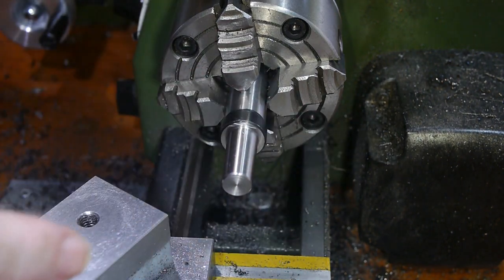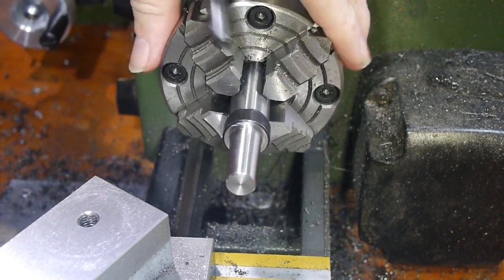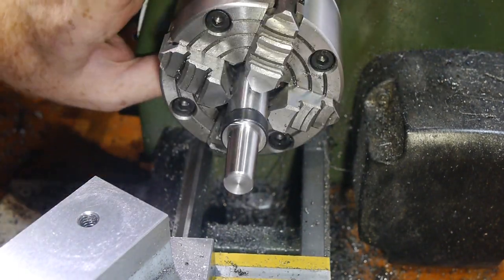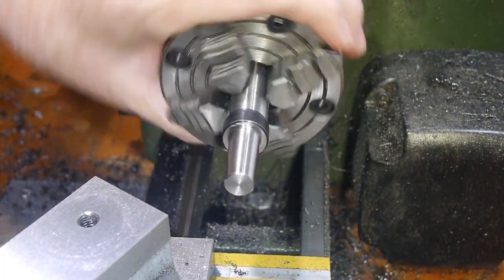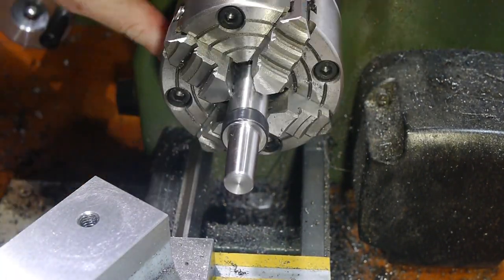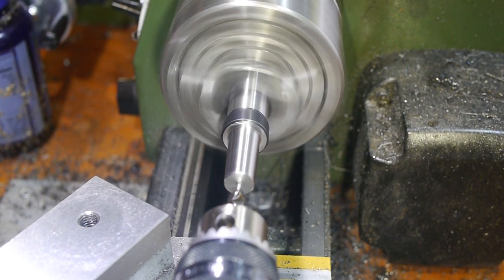I decided to lengthen the end with a shim. To ensure a solid fit, I decided to drill and thread the shaft and make a shim like a custom screw. I checked the protrusion of the Proxxon chuck shaft to determine exactly how much longer it needed to be. I indicated and centered the shaft off camera before center drilling.